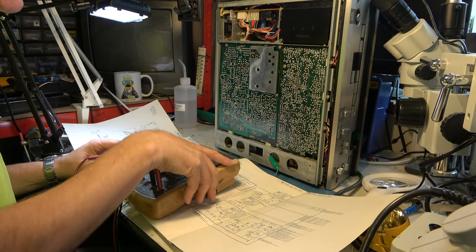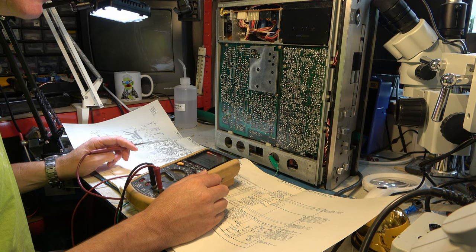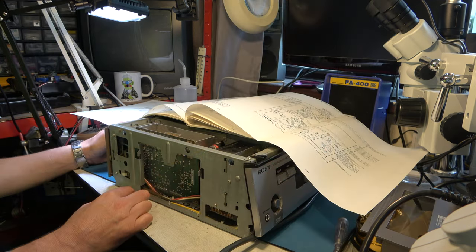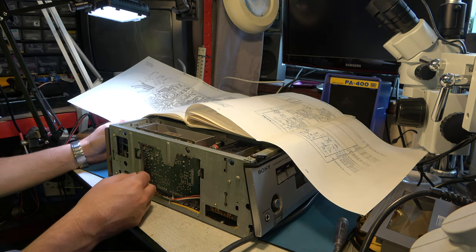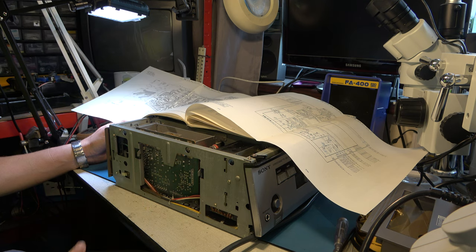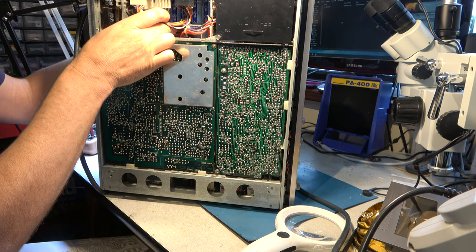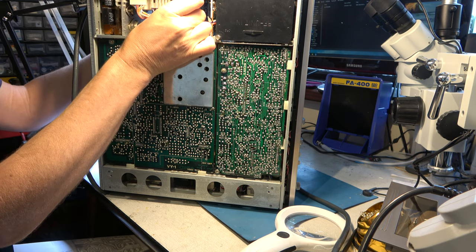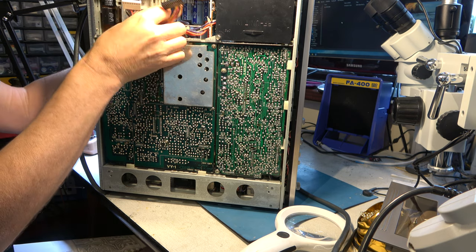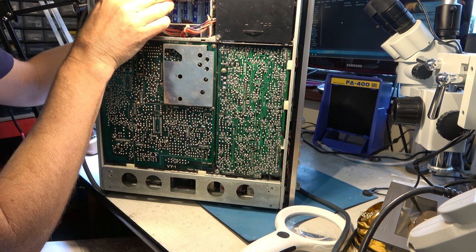There are only two diodes in the circuit. Unless it's a short circuit on the 5 volt rail somewhere, or a capacitor problem — not that likely. I'm really going to have to take the power supply out, because the diodes in question, D9 and D10, are buried under the metalwork. I can get to the power supply — I'll unplug the connectors underneath and hopefully get it out enough to reach those diodes.